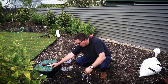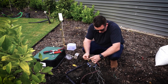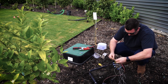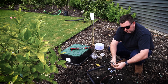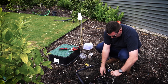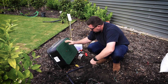For the white and yellows, we've got a smaller wire joiner that we sell which is a lot cheaper. You could use that for what I've done here. I'm just shoving that wire into the joiner and crushing that — that's protecting the end of that cable from getting damaged. This is what really should be done at the start when you're installing a new irrigation system if you're leaving cables in the ground. Cover them up with connectors like this, and then you've got two spare cables that are protected — it keeps the ends from rusting and getting dirty. Then get your zip ties, zip tie that all up nicely, sit it somewhere wherever you want it. From a wiring standpoint, that's done at both ends.